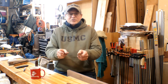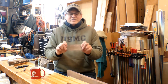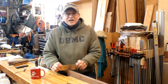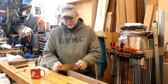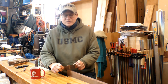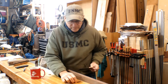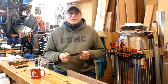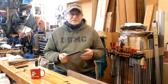The way I do this: two thumbs at the back, two fingers at the front, push forward slightly — creates a mild curve — at a 70 to 80 degree angle. I'm holding it at a 45 at the moment so you can see the curls that come off one side. Normally I do body-on and square, so you peel off a curl. The great thing about this tool is it's a problem solver — every toolbox should have one or two. Once you learn how to sharpen and use it, you'll be picking this thing up all the time.